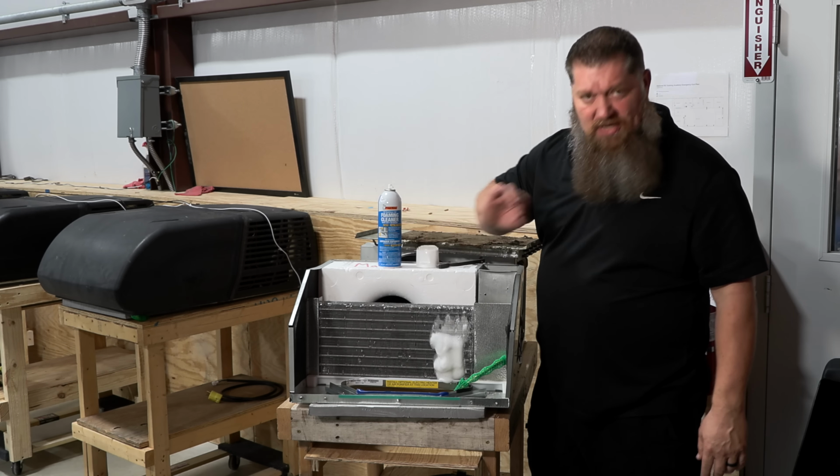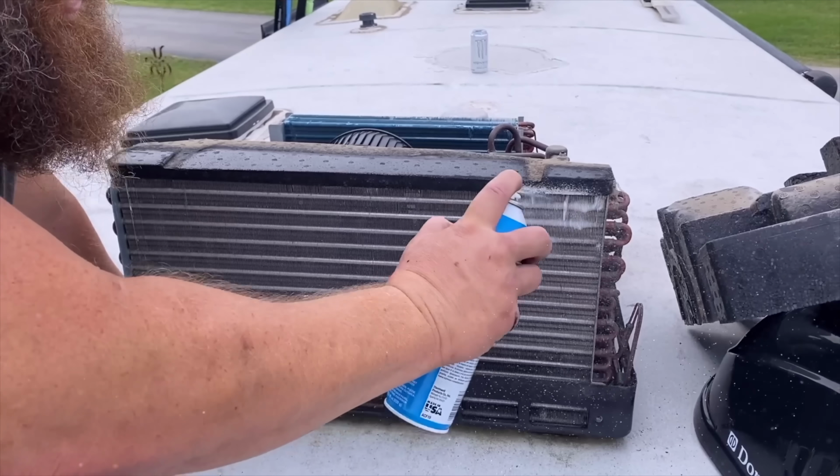While you're at it, I want you to look at what we call the condenser coils, same thing. These are the coils that are exposed to the outside air. Now, depending on your model, you want to look at which way the fan blows the air. Whichever way the fan blows into your coils, that's going to be the dirty side. In this particular model, it's going to be on the inside. So I'm going to look on the inside and I'm going to look at how much dirt is in these condenser coils. And I go through the same steps. I lightly brush off the dirt, maybe come back with a fine-tooth steel brush comb to try and get out some of the dirt on the inside, and carefully spray this in there.